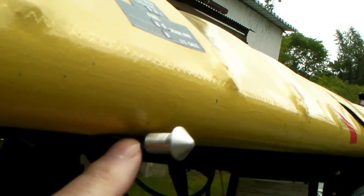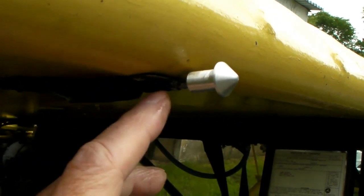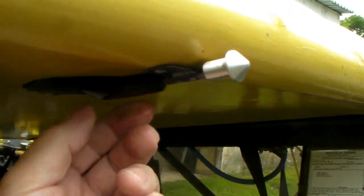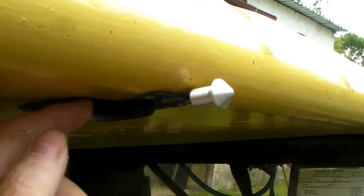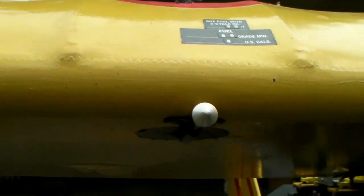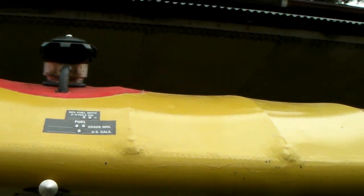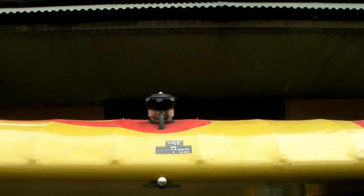I found pressure was not a good thing — sometimes it would force fuel from one tank into the other and it could overflow, with gasoline coming out the vent. So I put what I call a 'go faster' on there — those little pointy things — just attached with Loctite. The fuel vent itself is a piece of automotive brake line with a hose jammed on, and this hose goes to the tank on the other side, and vice versa, for safety — so if it flipped upside down or was parked off-camber.